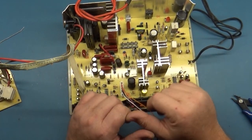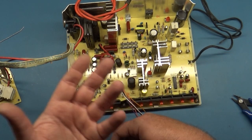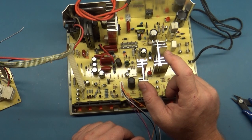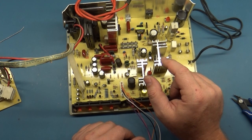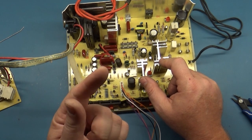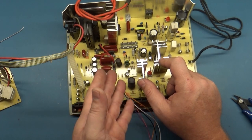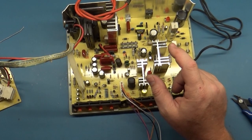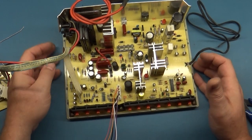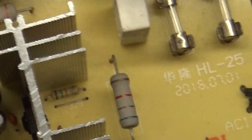I think what I'll do is test this and see if it works. The problem is I can't guarantee longevity. You could get three of these — two could burn up within an hour and the third could last forever. I've got a 19-inch version of one of these — a different model — running on a Vision Pro picture tube in a 1943 machine at the arcade, and it's been running with no problem for over two years, an average of eight hours a day. You can tell the model by 'HL 25' printed here for 25-inch.